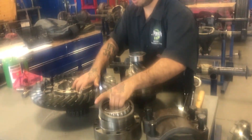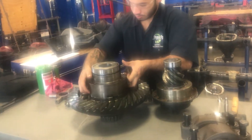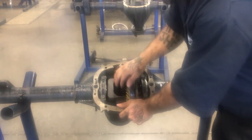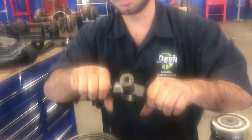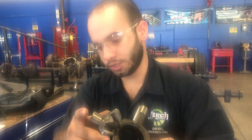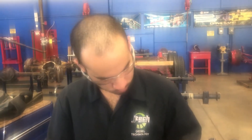This is also a little bit different because as your whole spider gear assembly is set in it, it basically covers up all your spider gears. It's more open — you can actually see that your spider gears are there. You'll be able to tell if you need to replace them. You also want to be inspecting your cross to make sure you don't see any discoloring. If you see discoloring, that means the spider gears are seized up on the cross — that can cause overheating, excessive wear, and a wobble.